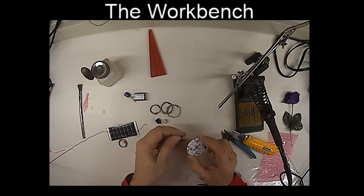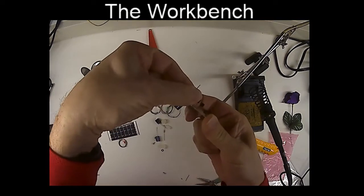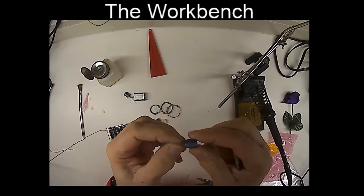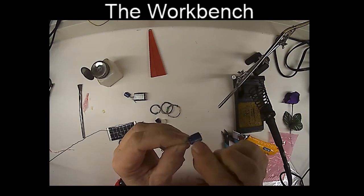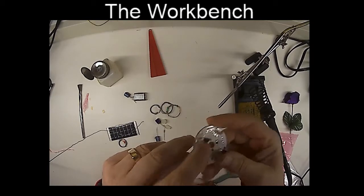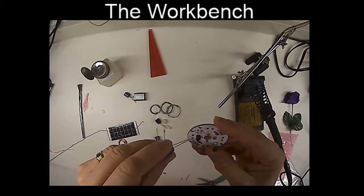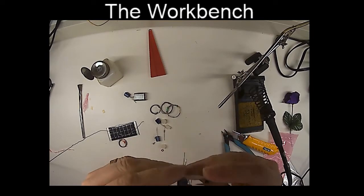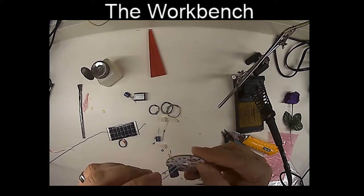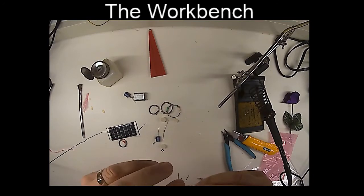With the plant, you can put the capacitors facing down on this side of the board like this. But for an animal, we're going to place the capacitors facing up. Now the capacitors have a polarity. This big white side right here marks the negative side. It's also the shorter of the two leads on the capacitor. And you can see there's positive and negative marked on the capacitor here. So I'm just going to put that in there like that. I'm going to just spread the lead so it doesn't pop out. And I'm going to put all 4 capacitors in real fast. And there's the second one.